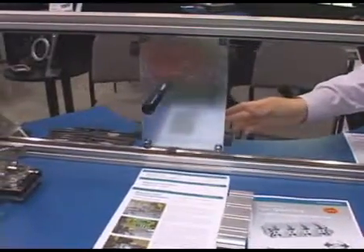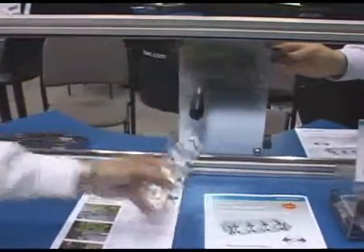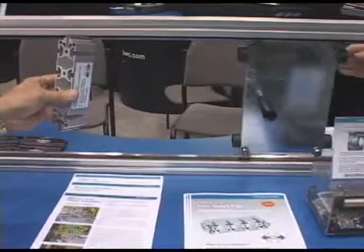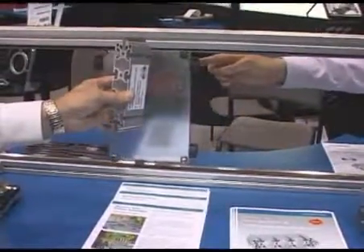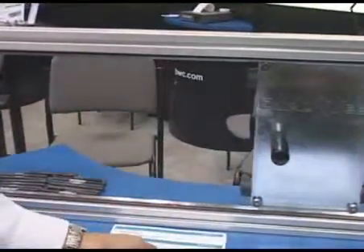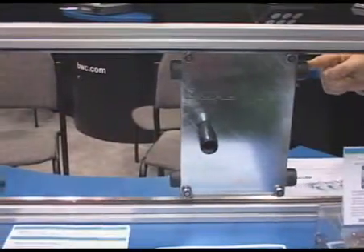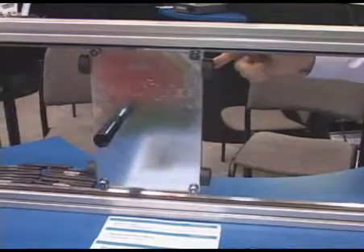This is our new QuickTrack. The QuickTrack is a piece of track that gets pressed into aluminum extrusion and inserted with a rubber mallet into any metric T-slot. As you can see, you can attach four wheels and move a very heavy load. The bottom two wheels are fixed and the top two wheels are adjustable.